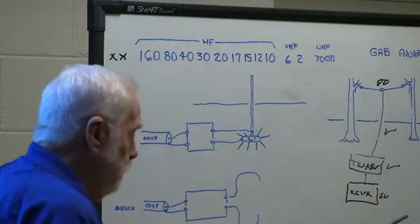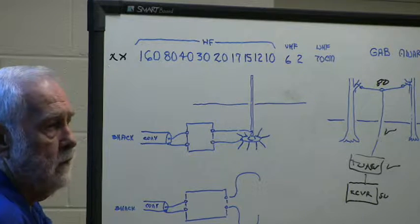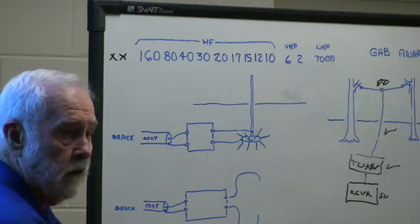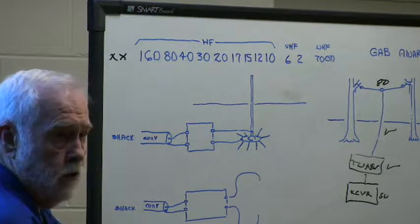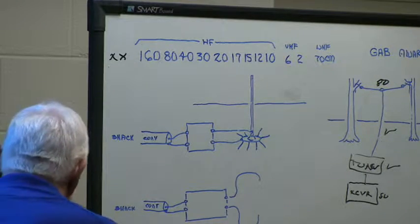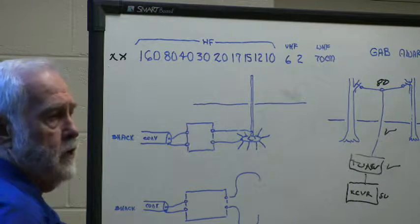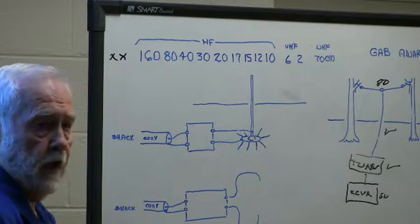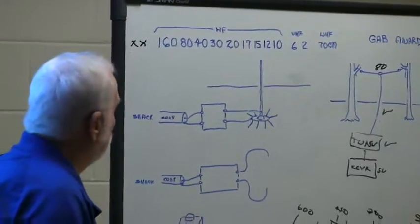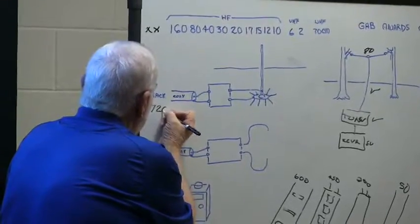Don't think, and I've heard this more than once, I've got a well casing that goes down 600 feet. It's great for lightning protection, but it won't buy you a dime toward making that thing work. So you've got to invest in a radial system. Now I've found that you can make your point easier with numbers than you can just saying something goes up or down. That's why we showed the impedance slide with the length of the transmission line. So let's take and make it 7,200 kc.